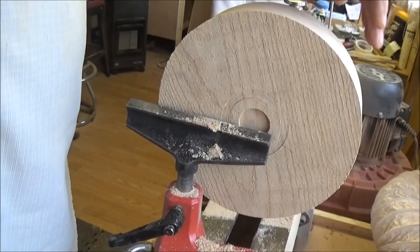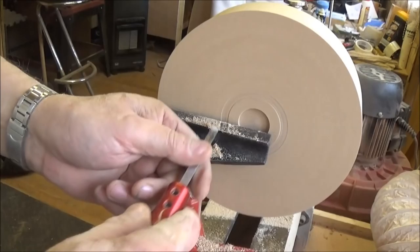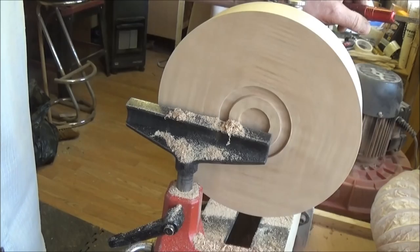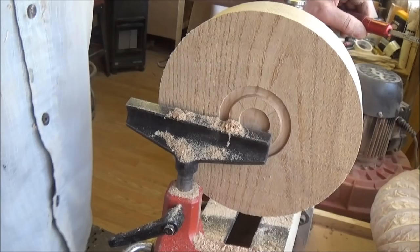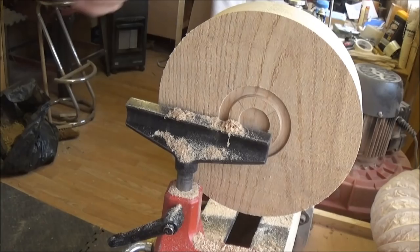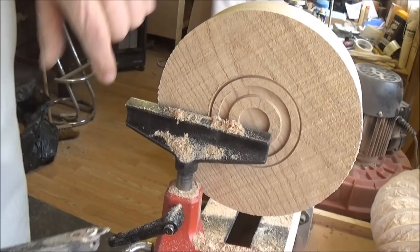Just a little bit more, but I can turn the speed up a bit now. This wood is a good two inches thick — it seems a shame to just turn a lot of this away. I'm wondering if I could keep the platter itself quite shallow but maybe put a bit of a foot on it, so it stands about an inch off the surface. I'm just starting on the mortise now. I had to make a tenon on the other end so I could get it in the jaws of the chuck to do a mortise this end. I should have used just a screw chuck really — I wouldn't have had all that hassle — but I couldn't be bothered, so I'll just carry on with this mortise.